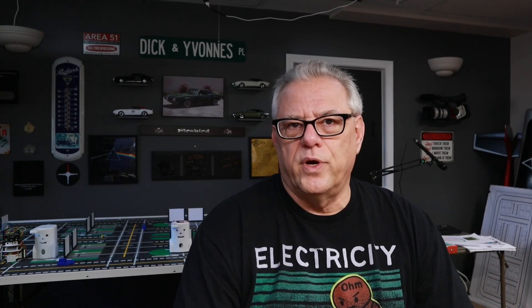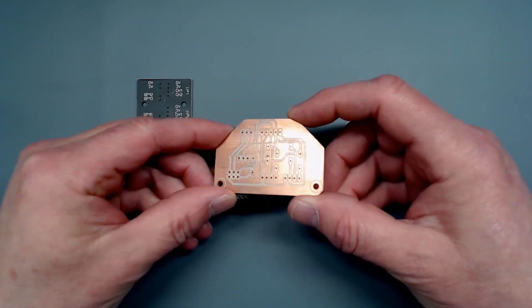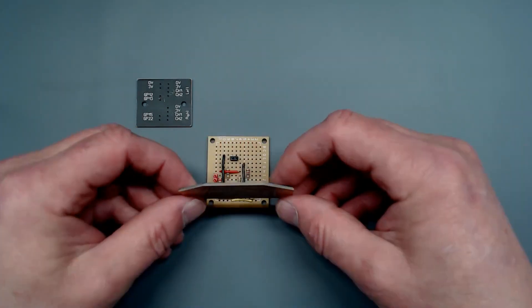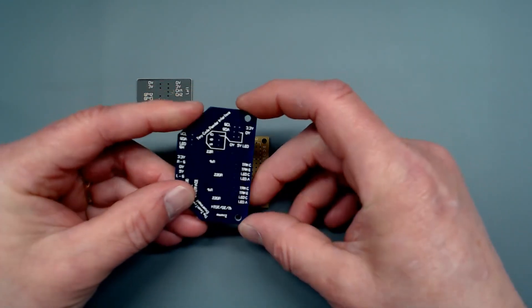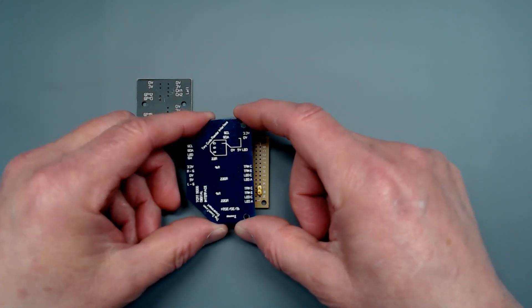Our focus for this series is isolation milling, which describes a process wherein a CNC machine uses a tool to cut channels in the copper-clad board to isolate areas of copper from one another. Because the machine is a CNC milling-type machine tool, it is very flexible in what it can do — we can do milling, drilling, cutting, and engraving.